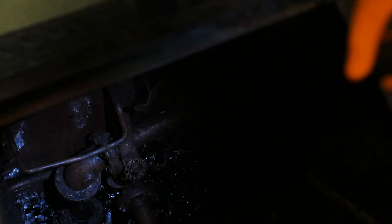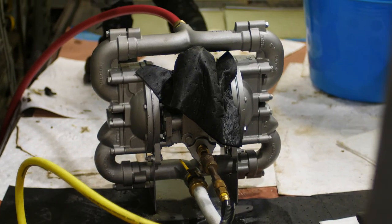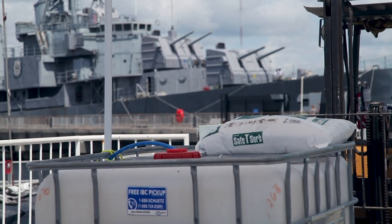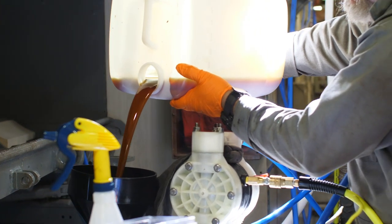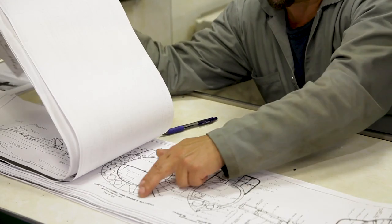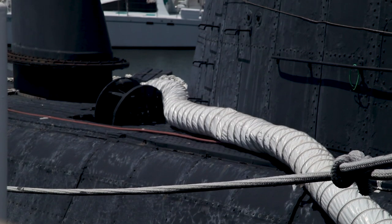We use the microbes to see if we can get that a little bit better. But that is not how it would be left if it eventually goes to be towed for a reef. Once all the oil's out, because it's difficult to get down into the bilge, we're going to use microorganisms to clean out the bilges and the external fuel tanks. These bacteria ingest any hydrocarbon, which is any sort of oil or natural gas, and what they produce is water and CO2, and those are both safe. Without anything else to eat, they die, and then the whole system can be removed. They just turn back into carbon. It's a little tricky because you need to aerate and have a lot of movement to keep it going, but it is amazingly efficient, and it's amazingly clean.